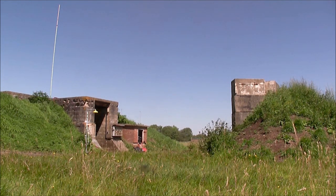That was 8.5 tons of tarmac, and basically what had happened was it was the hottest day of the year. In the apron just outside the test cell, there was a slight ridge. The plume was fully attached to the floor by the time it came into contact with that. It just lifted slightly, pulled a vacuum over that area of tarmac, and lifted it off. Would anybody like to see that video again?